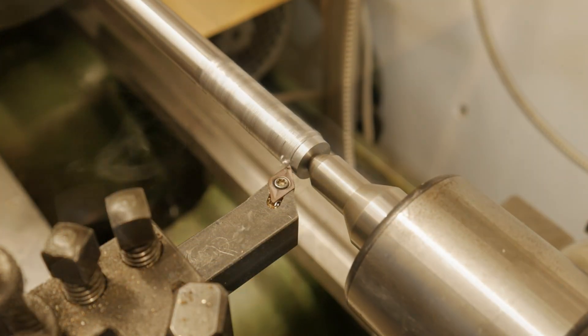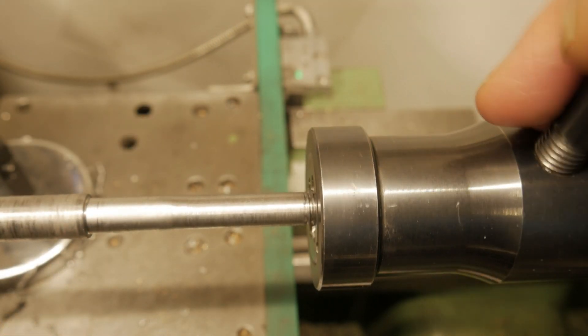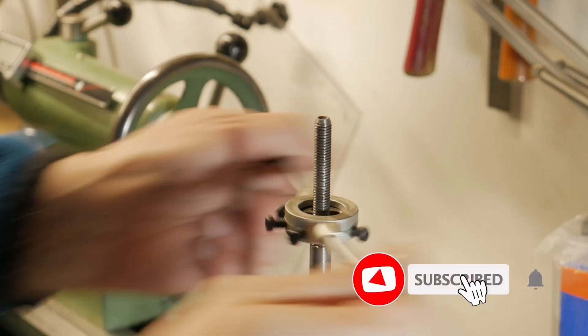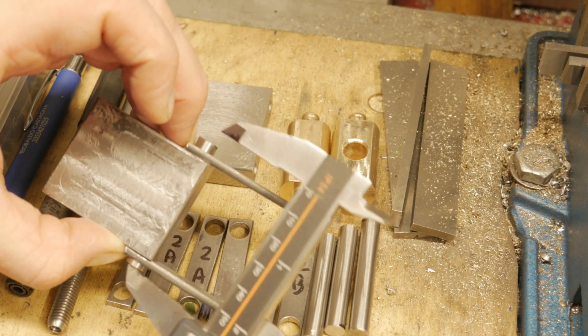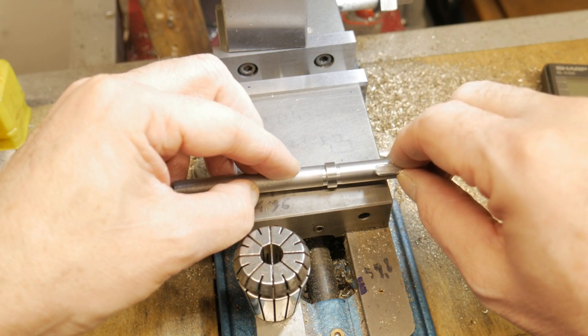It arrived the moment to make the M8 screw. I use the same process for the bronze bar and make all the diameters at the same time. The beginning of the screw I make with the device, but after I finish by hand. All the connecting rods are joined by a pin that is 8 millimeters. I use the same process to make the groove for the elastic ring and the result was very good — the ring makes a little pressure on the connecting rods.